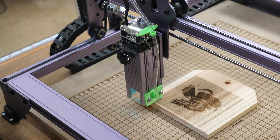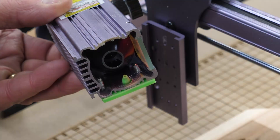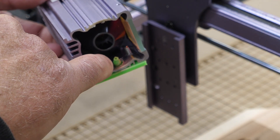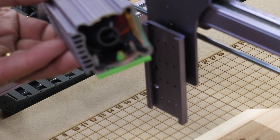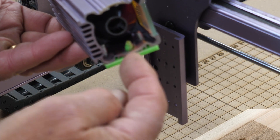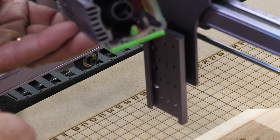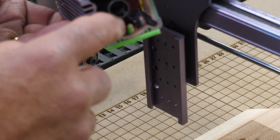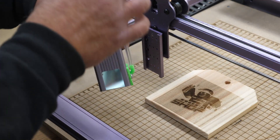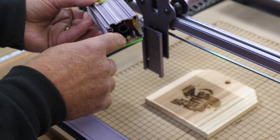Let me take this head off and give you a close-up of how it was drilled. This is kind of hard to get a good camera angle on. As you can see right here, about a half inch up, I drilled a 5/16 hole at an angle — about a 45-degree angle — down towards the base. This is how it allowed that nozzle to come through. I had to do a little guessing on this to get that air stream right into where the laser was cutting. This works out perfectly. I'll put links to these 3D printed pieces in the description. As you see, I did have to drill that housing.